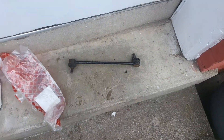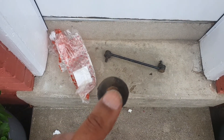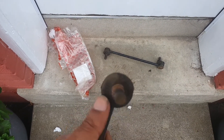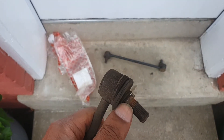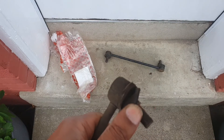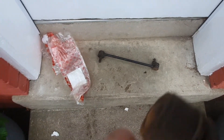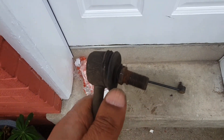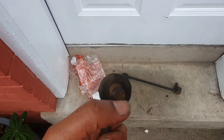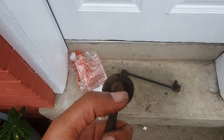Normally on the end of this bolt here you would have an allen key socket, so you just drop an allen key into there and tighten the nut around — that will stop it rotating. On these eBay ones, you have a collar on this side which is held with a spanner. But when you hold it with a spanner you can end up damaging this diaphragm as well, so it's not a great idea. It's always better to buy one with a little allen key tightener — you put the allen key on and use a regular spanner to tighten it.